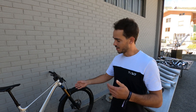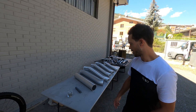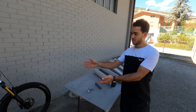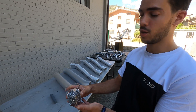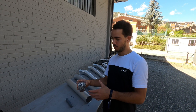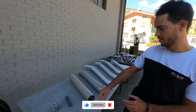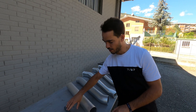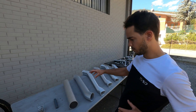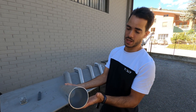Maybe we can just go through all the effort and development process we went through — I mean, I've been working on this one for about three years, so it's quite a lot of time. For example, just for a part like the down tube, which might look quite simple, we start from 6061 aluminium alloy with magnesium and silicon as alloying elements. We melt this, cast it into a mold, then we get a billet of alloy, then we pierce it with a mandrel through a die — we do this multiple times until we get a tube. This is where we start.